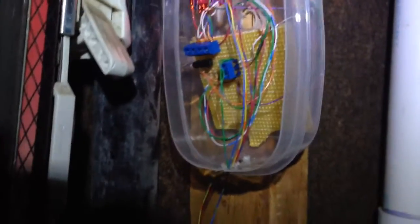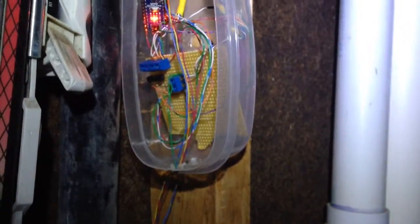There's one red, one green, and one white LED. The white indicates the Arduino is powered on and running code. The green indicates measurements are being taken and you should proceed closer to the ideal parking position. Once you've achieved the perfect parking position, the red LEDs will go solid.